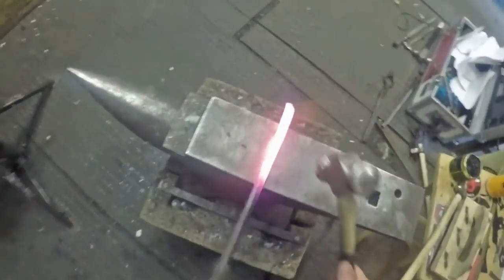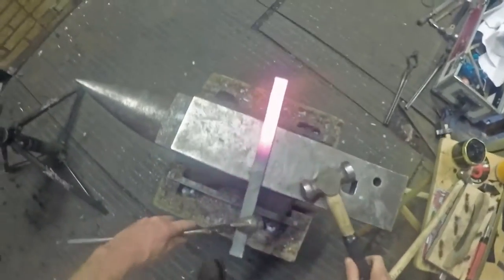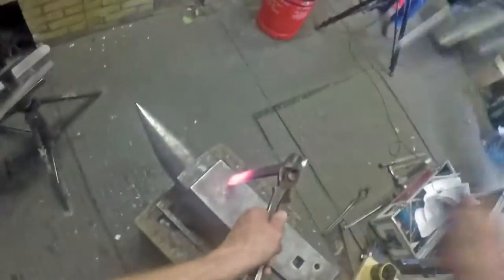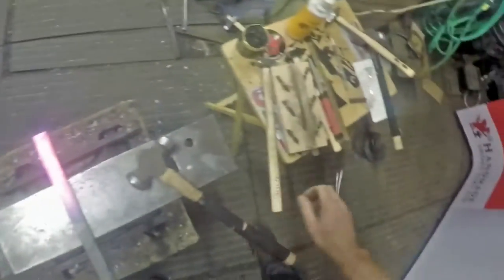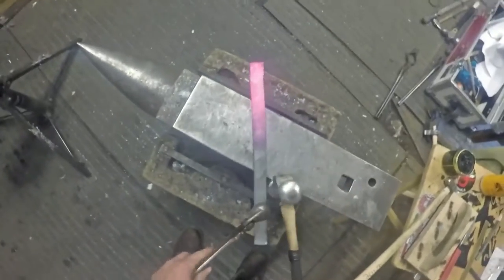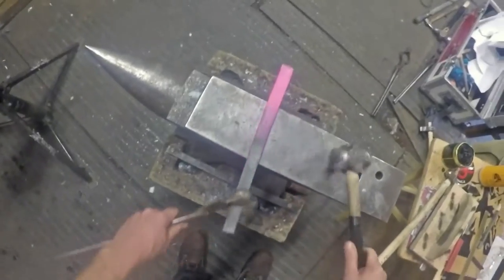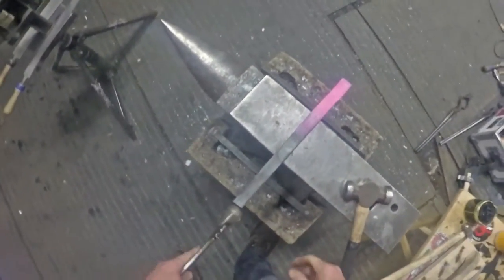It's only a thin section. If it was a thicker section I know I'd probably jump each quarter into it. With it being a thin section it tends to bend and twist, and you spend a lot of time straightening out the twist - every time it buckles you've got to forge those little bends out. That should now be 14 and a half - yep, spot on 14 and a half inches. So that's one heat, I know I've jumped an inch into it. Starting with 15 and a half, because I make a lot of shoes, I know in one heat I'm going to jump an inch in - it's made my life a bit easier.